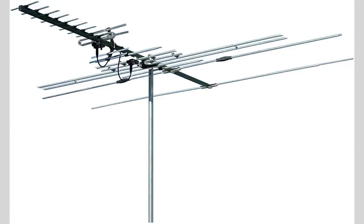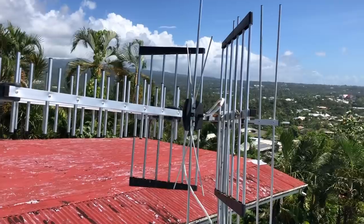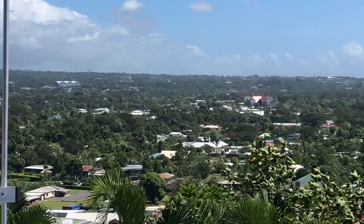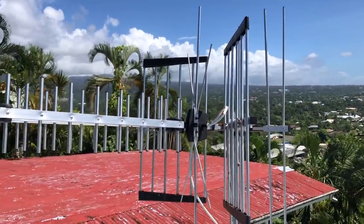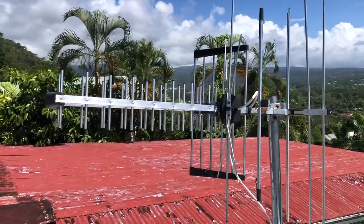As you can see, this is a combination UHF and VHF antenna — this is my antenna at the house. Let's go take a look at it so I can show you everything that's wrong. My antenna is a VHF and UHF combination but it's pointed the wrong way — it needs to be pointed towards that big broadcasting antenna in Vitele. Also, my dipoles need to be horizontal, polarized horizontally instead of vertically. So let's get that switched out.